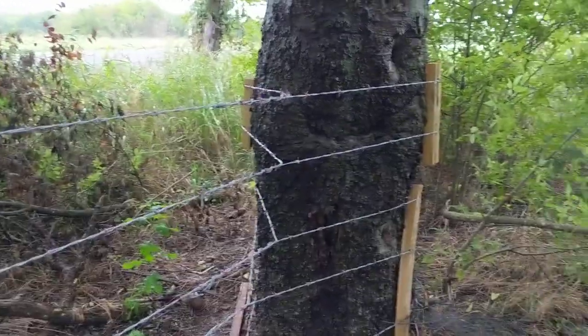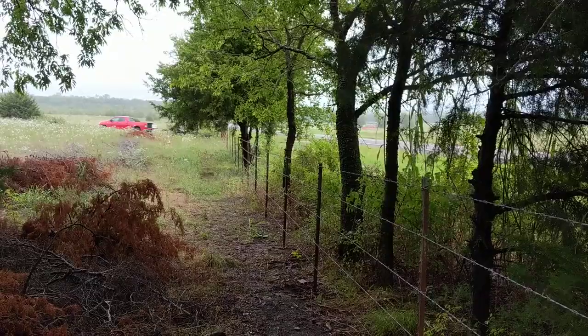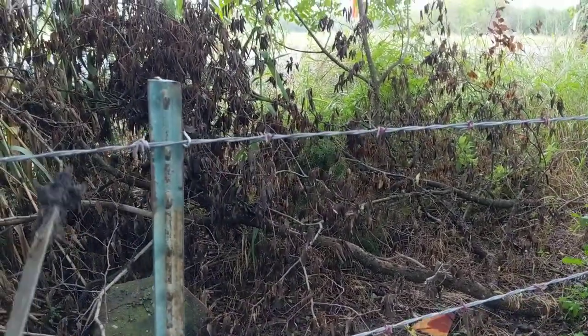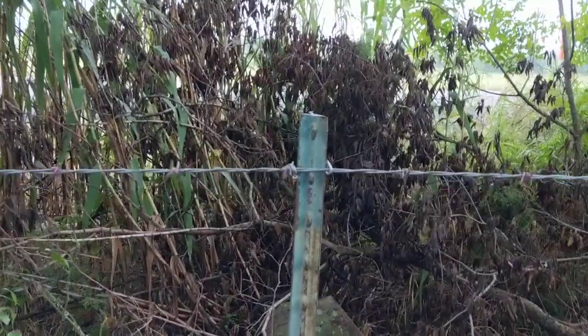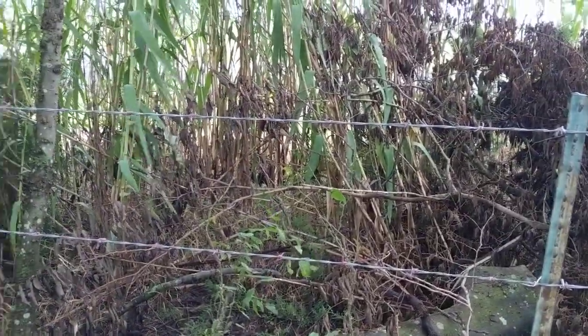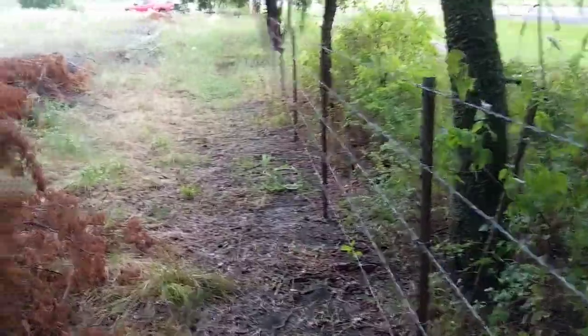Anyway, I just shared this with you. There's the fence line all the way to more or less where the truck is in a straight line. The posts are about ten feet apart — three, three and a half paces of mine. It's four-point barbed wire, Red Brand, and I'm putting it about every ten inches using the fencing tool — the one that looks like a little hammer — as the distance between strands.